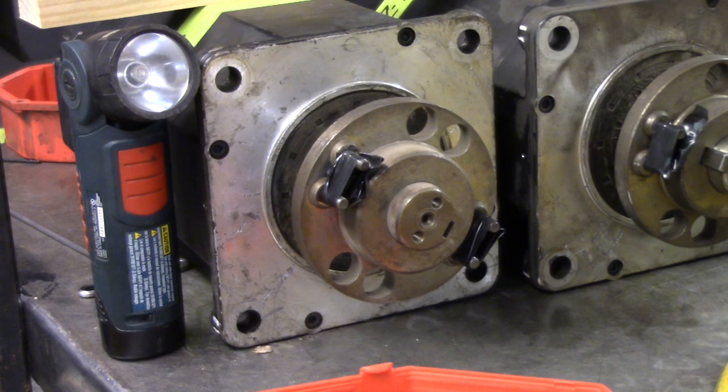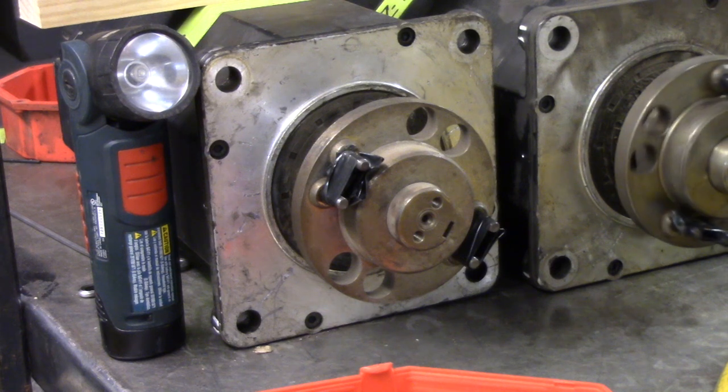Finally, press F10 go, and the shaft should rotate, so we're going to do that. And there you see the shaft rotating. The first move sync rotation may cause the motor to jerk or move roughly. Move sync a few more times by pressing F2 move sync, then F10 go repeatedly. All move syncs after the first sync should cause the shaft to rotate smoothly. If the motor oscillates wildly, moves erratically, or makes loud, unusual noises, kill the motor power immediately.